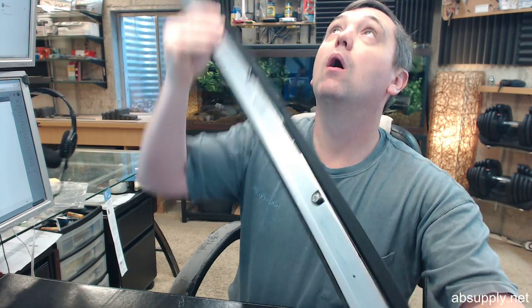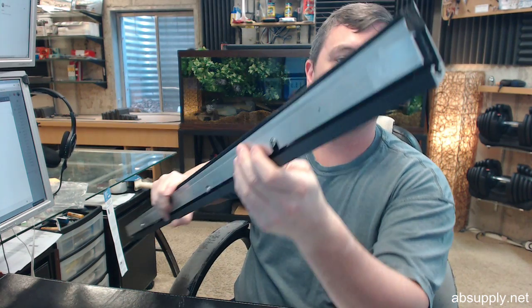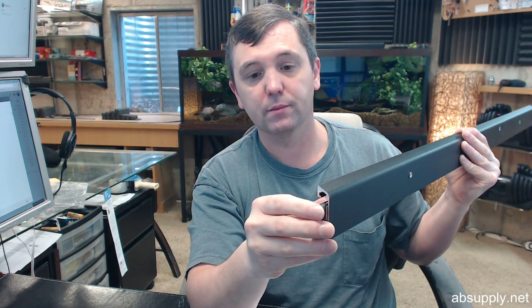When you mount this on the push side — meaning the keyed or exterior side — you will mount it on the face of the door between the stops of the frame. Take the dimension between the stops, deduct an eighth of an inch, and that will be the net size item that you want. The bolt side is always the hinge side of the door; the other end is always the lock side.